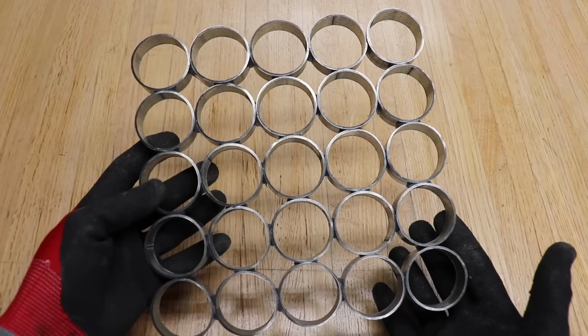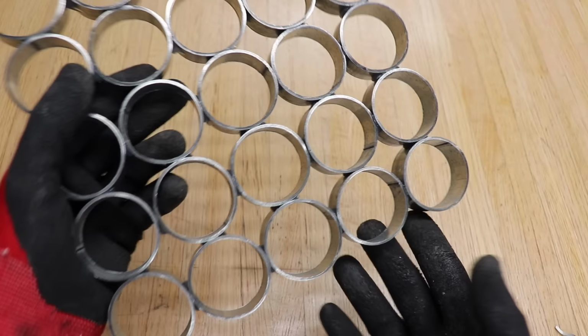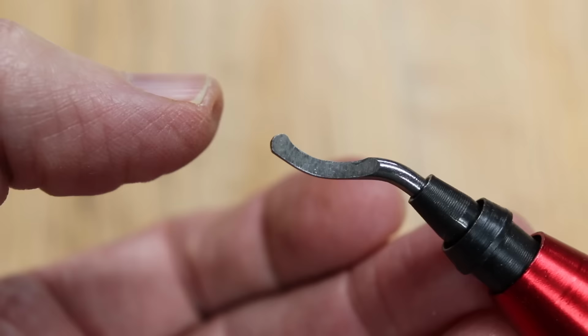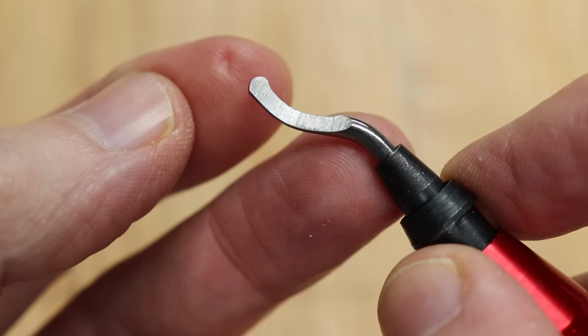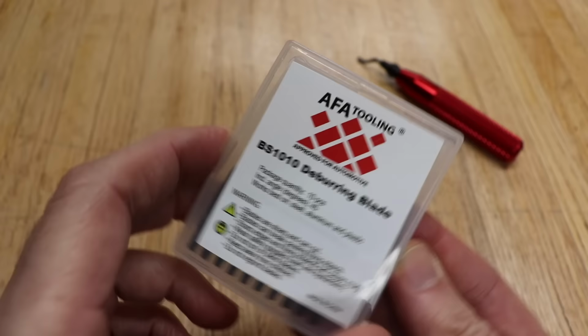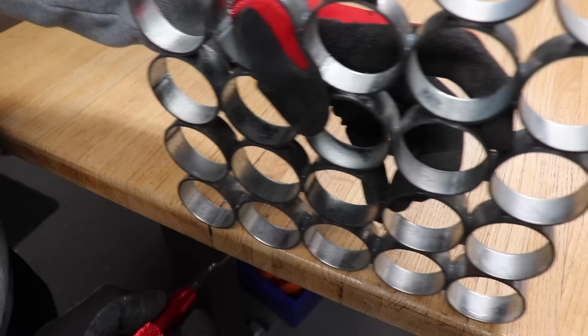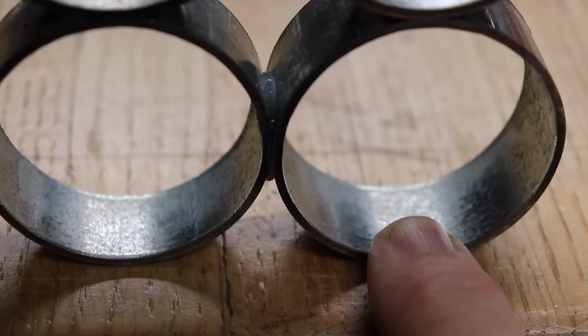So after you have these assembled, you'll notice from using the pipe cutter that it has left a burr inside of each of the pipes. But this deburring tool is perfect for removing that. The cutting tips are removable, and it comes with 10 additional cutting tips. And if you want one of these, I'll have it linked in the description under the video. They do a nice job of smoothing out the edge.